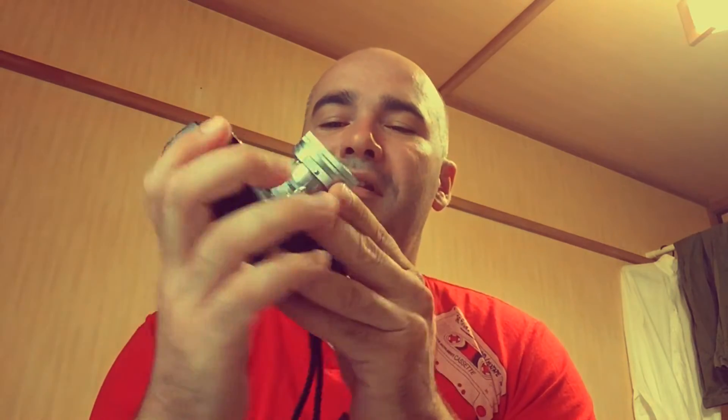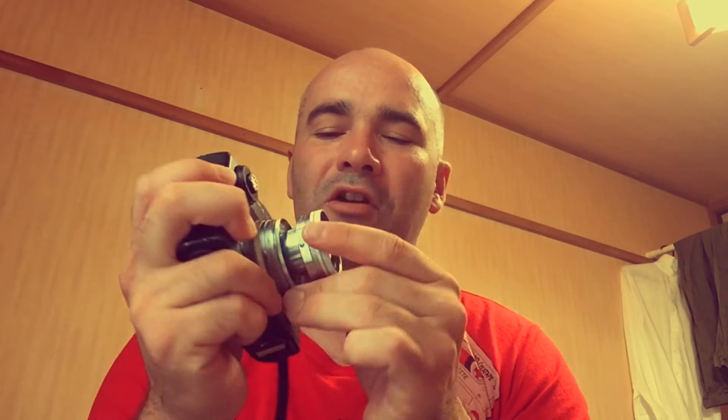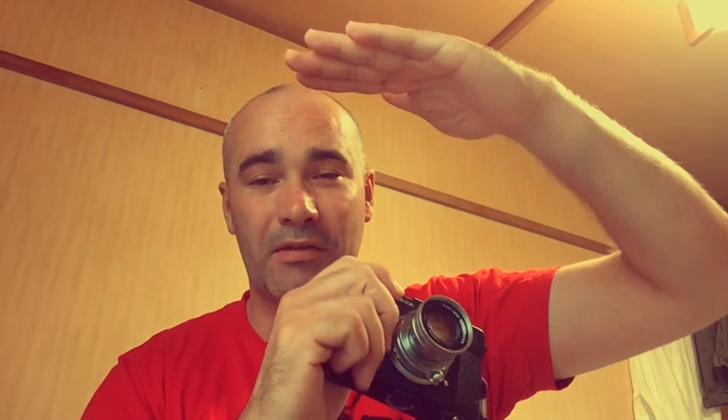This is a camera made from the 70s, and with most rangefinders, if it's never had a rangefinder adjustment, it's most likely going to need one. Because if you don't, even if you think you're in focus, you're not. There could even be points where your vertical focusing point will never get into range. That's what happened with this one, so I had to get the rangefinder adjusted.